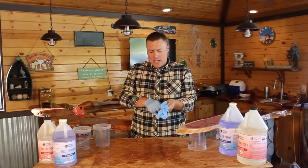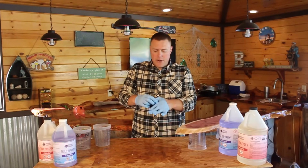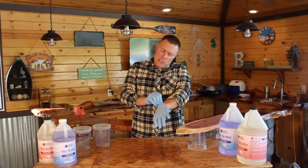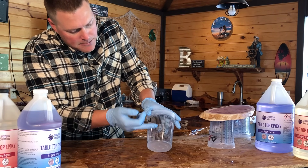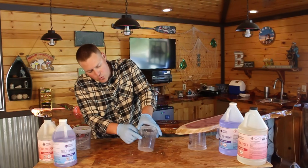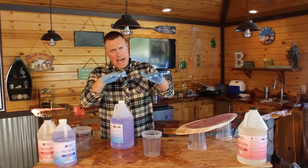I'm going to go ahead and mix up our epoxy. We have graduated containers in front of me that have all the ratios outlined. As I mentioned, it is a one-to-one mix ratio by volume, so it's a relatively easy pour to mix up. We have these graduated containers — here is your one-to-one mix. We're going to pour a lot of this today, so go ahead and pour the one-to-one mix, and take your time on a level surface to make sure you're reading the levels accurately.